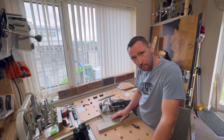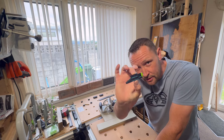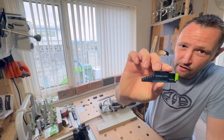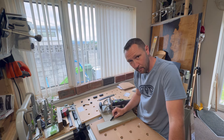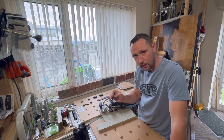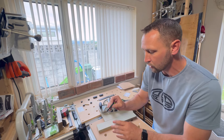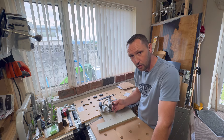This is the simple answer I've found to stop one of your misalignment problems. It's a little tiny thing - it's got readings, scales, and everything on there that we need. All we've got to do is change this in the Domino, and on here we have 18mm, which is going to stop one of the misalignment problems. It's got normal sheet material sizes used in the UK - 12mm, 15mm, 18mm, 19mm, 22mm, 25mm, and 40mm. The biggest ones for me are 12 and 18, which are the most commonly used stock sheet material sizes in the UK.